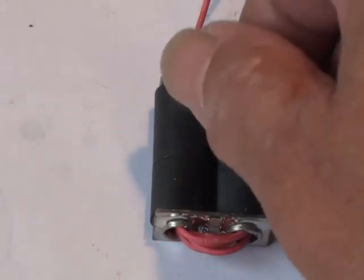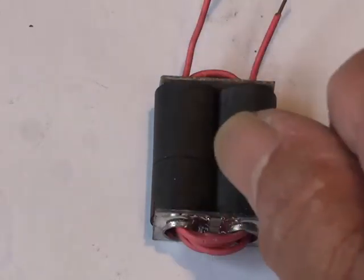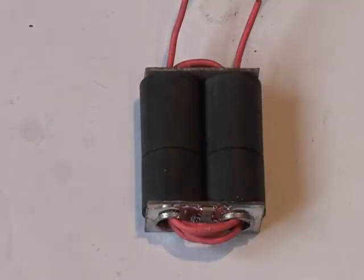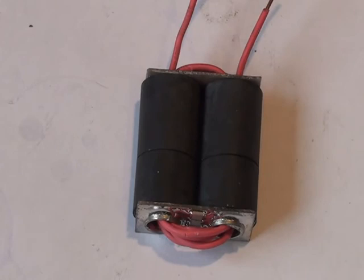When building it, try to just gently pull the wire through rather than tugging on it. Guide it through with your fingers and use your thumb on the loop end so it doesn't come out too large a loop. This is a low cost solution to trying to obtain Teflon wire of the right size that will fit these transformers.